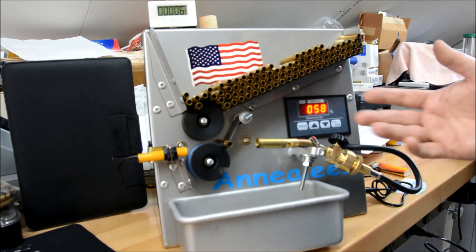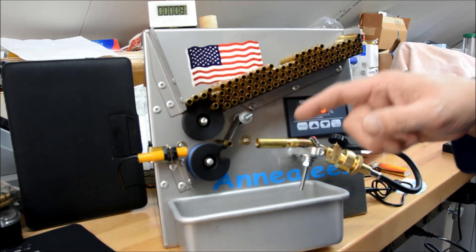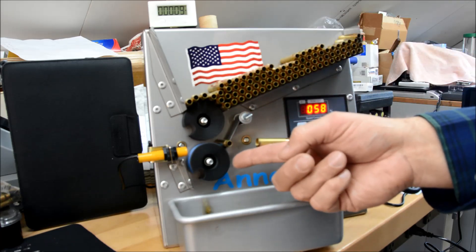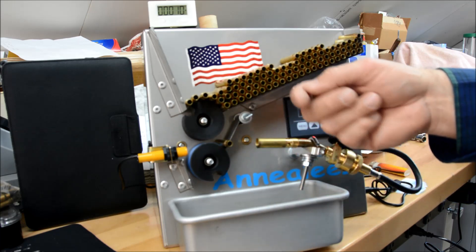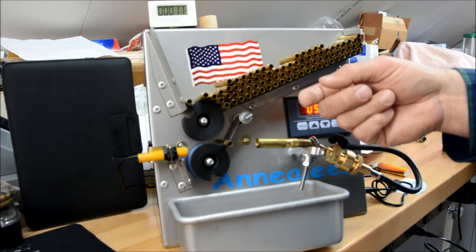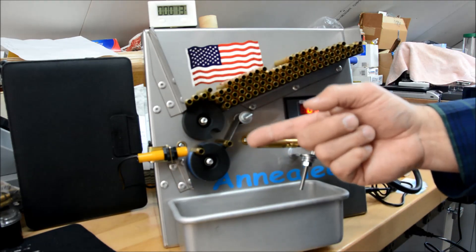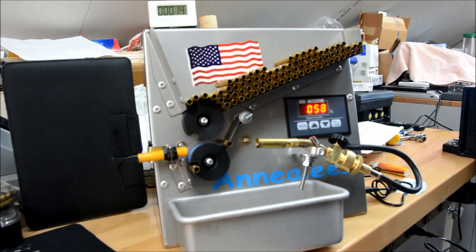You didn't have to drill or modify your annealer. I'll show in a picture as well the way I've done it, because this is a magnetic or ferrous proximity switch, and you need a magnetic source to trip it, which is actually buried inside the wheel at the back. I just dremeled out a slot — this wheel is solid — dremeled out a slot and put it in there and fastened it in place with a little bit of quick slip just to keep it from coming out. The magnet is actually faced perpendicular to this; it's a round magnet so the large diameter or flat face is facing perpendicular so you can get the most exposure to the magnetic field at that proximity switch.